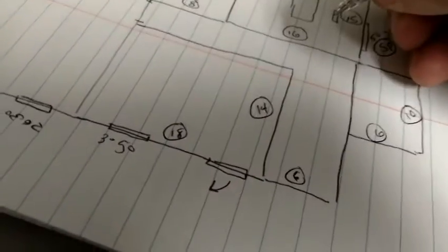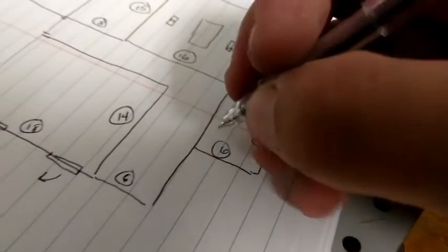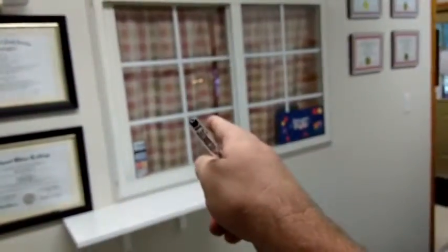In the kitchen, it looks like a good outlet location. We have a relatively short wall work area here, so a nice one running laterally here, and one laterally over here — keep this place pretty cool and spread on that airflow. So we can go ahead and draw them tentatively in here. This is not going to be exact — I'll come back and add particular CFM and sizes. We have one here in this room as well, but that room is beyond this glass, so it'll be difficult getting the duct in there because these areas are separated.